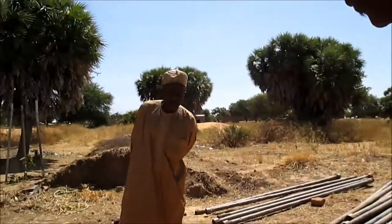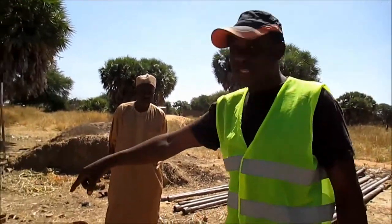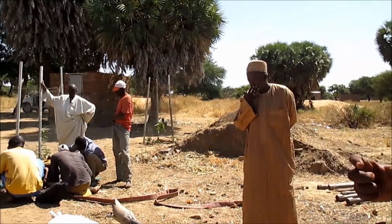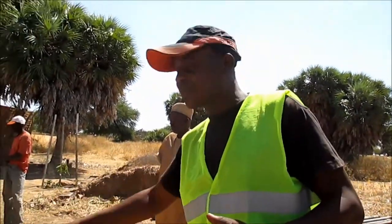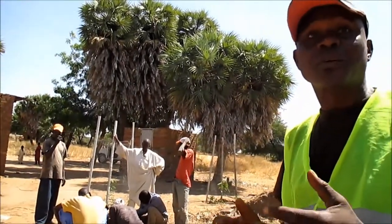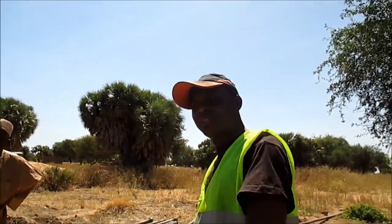Now this is three point something meters, 3.10, 3.7. When it goes down, one process of drilling, we take our sample, a meter, at times 3 meters. When this whole drilling rod went down, we take a sample. So you collect samples every 3 meters? Whenever we add a drill rod, we take another sample. At times, we take a sample every meter.